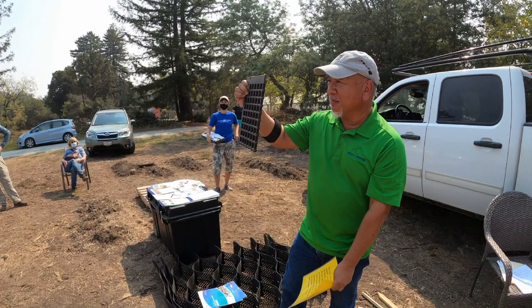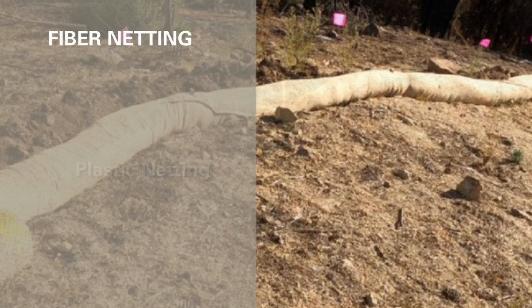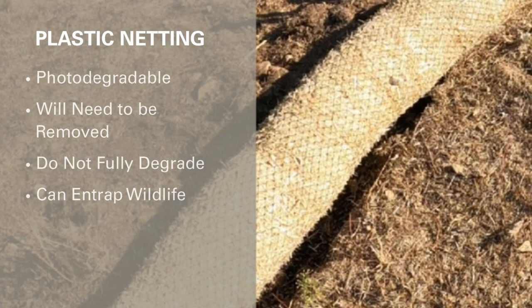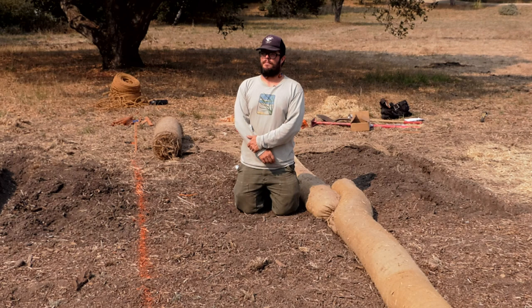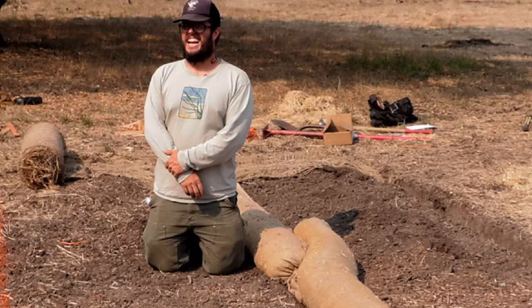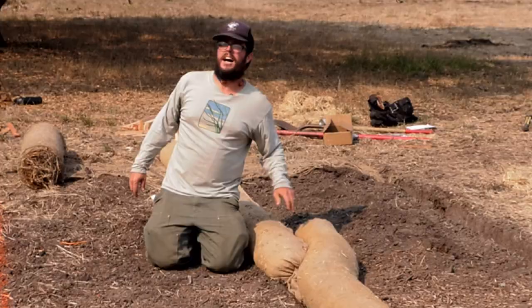There are two types of wattles: fiber netting and plastic netting. Fiber netting wattles are biodegradable and in some applications may be left on site to decompose and allow vegetation to grow through them. Plastic netting wattles, however, will eventually need to be removed because they will not fully degrade and can entrap wildlife. Using a straw wattle around a toxic cleanup area, it may be better to use the plastic because it doesn't fall apart as readily. Ninety-nine percent of the time, fiber is a better choice than the plastic ones.